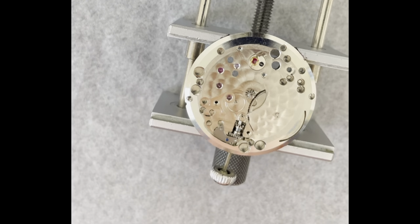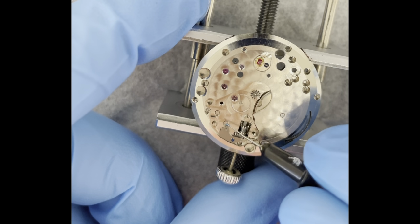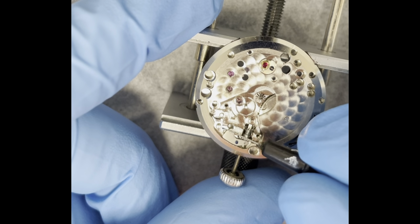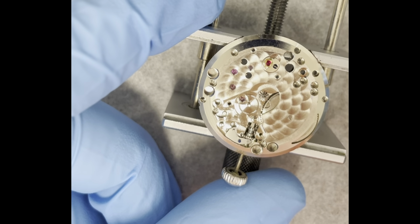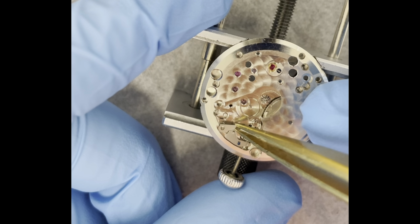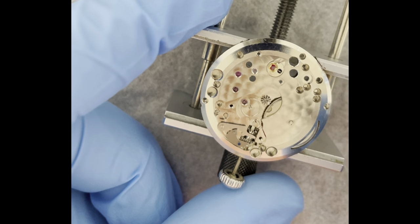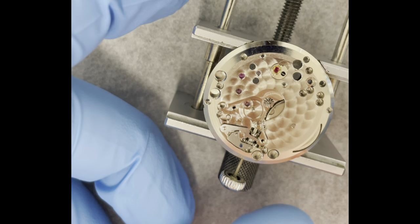And for those two positions to engage properly, we're going to fit the yoke lever spring, setting, intermediate setting gear, and our setting lever spring. We can start with the yoke lever here. The rule of thumb is anywhere there's kind of a touching sliding surface, you put a little bit of grease, it helps it.